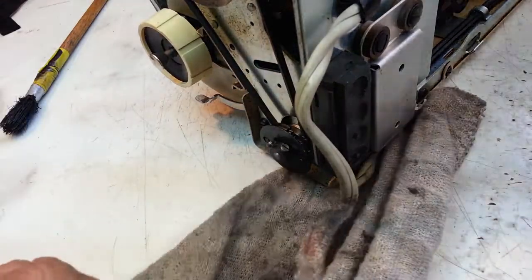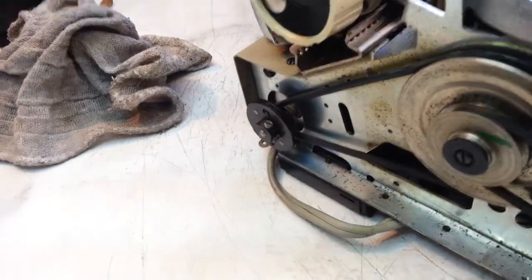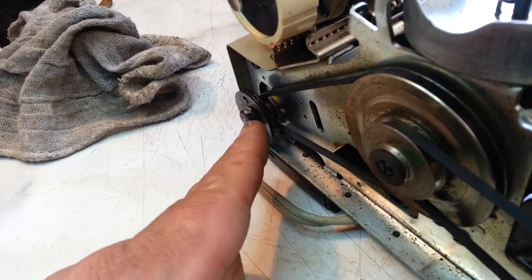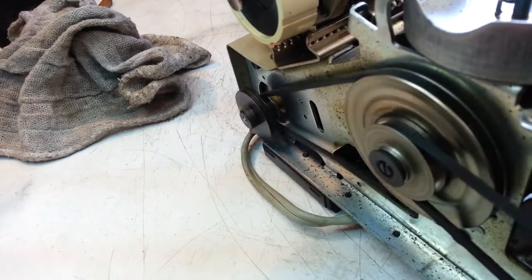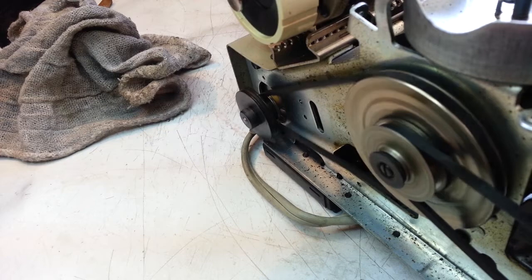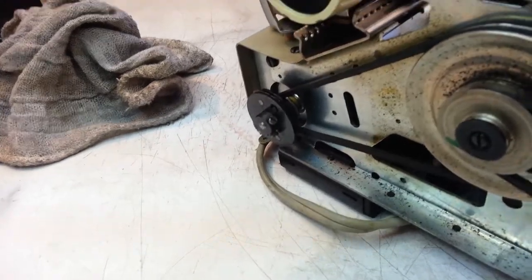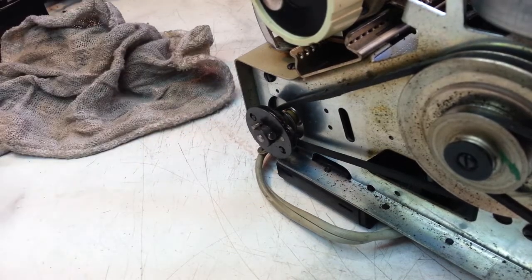Okay, so this should start up properly this time. So if I hold this, now the motor clutch should spin first - and it does. That's the way to do that. Pretty simple little procedure, but it's pretty common on these electric Smith Coronas from this era. Alright, Phoenix Typewriter - motor clutch rebuilt. Good day.